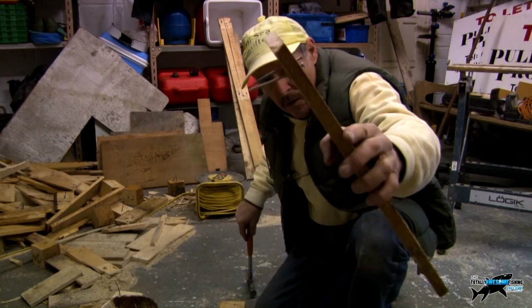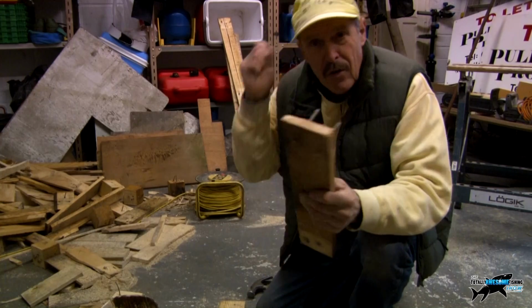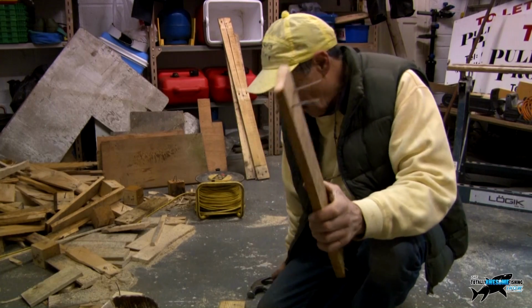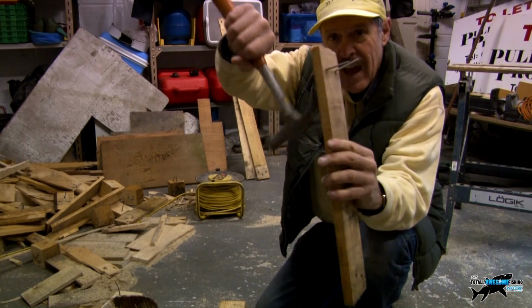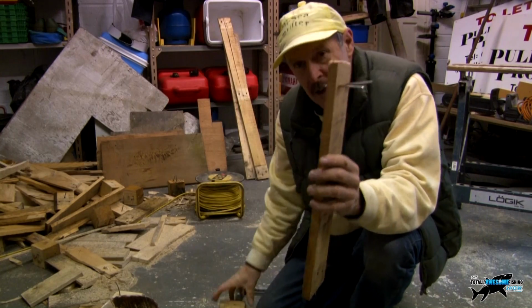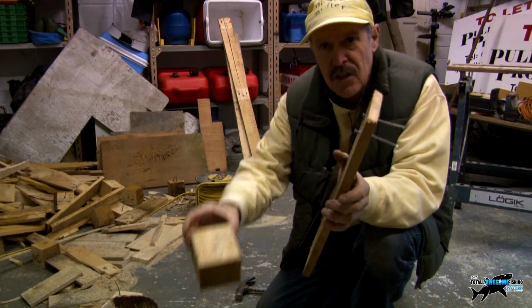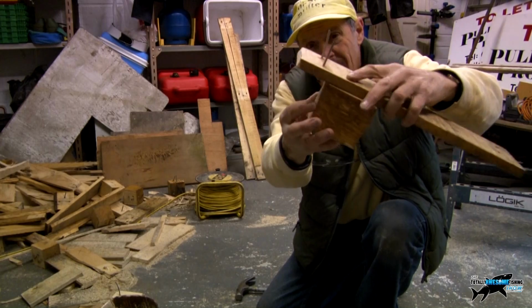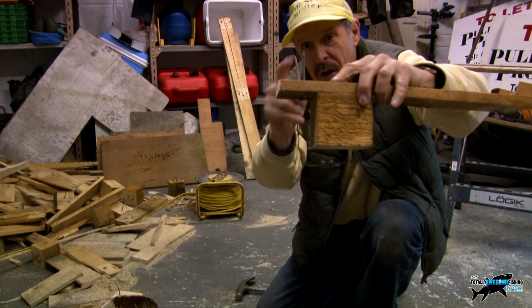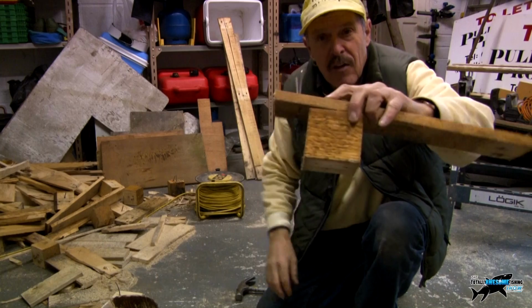You've got to get the nails out of the wood. Don't do it on top of your workbench. You'll just end up breaking up your workbench as you hammer the pointy ends through, which you have to, to get hold of enough head to be able to get the claw hammer on it. Put it on a nice flat hard surface and get yourself one of the blocks of wood that you've got off the pallet to support it like this, as close as you can to the edge of that block. This takes all the shock, and they'll come out much easier.